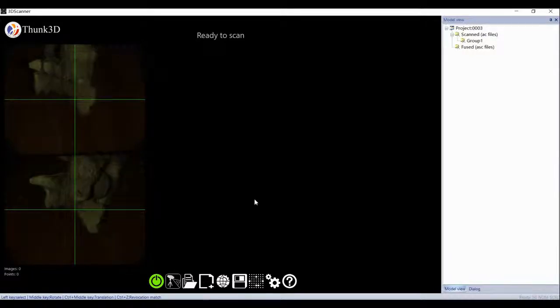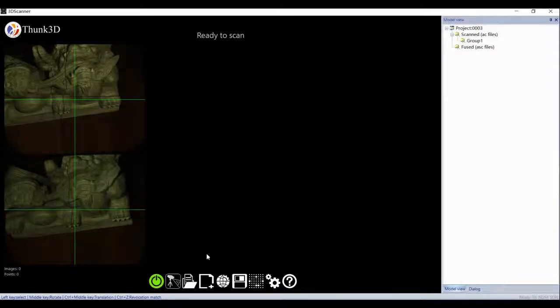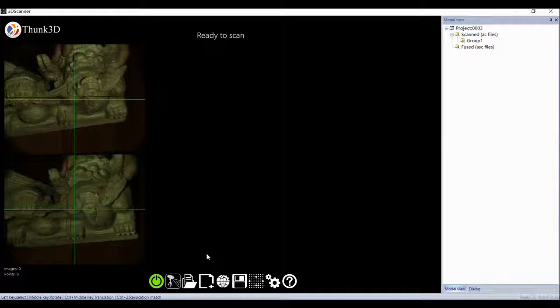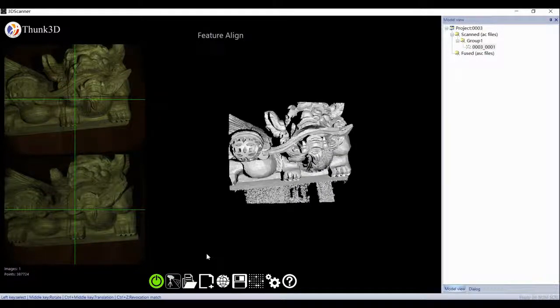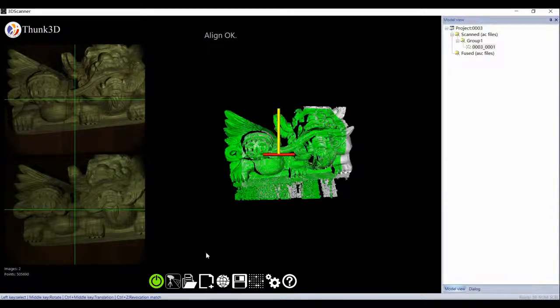There is one point I'd like to repeat again and again: the working distance from the raster to the target surface is around 49 cm, subject to the clearest cross. Please double check the cross; the clearer it is, the better the frame quality. Left click the scan icon or press the space key to scan, then move the target and scan again, and so on. But please keep the target still when projecting and ensure common features between scans.